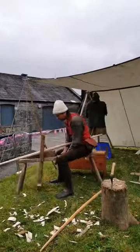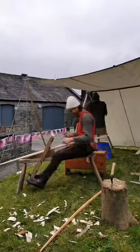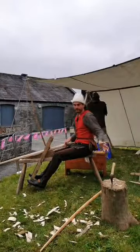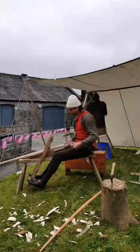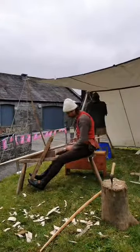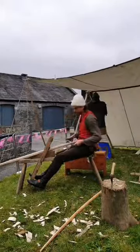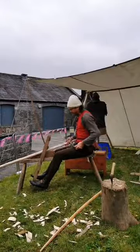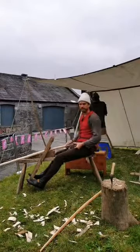You can see a bit better now. The stave is now small enough from the split — as I was showing you with the axe — that it will fit onto the shaving horse. I'm using my legs to clamp it in place and then using the draw knife to shape the stave. I'm taking off corners and high spots from the last time I was working this particular piece of ash. It had been shaped down and there are flat spots and high spots, and I'm taking those off to round it as I go.